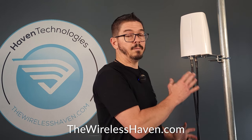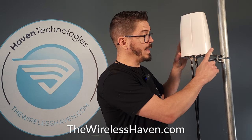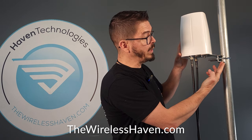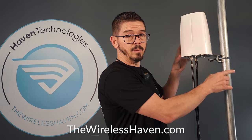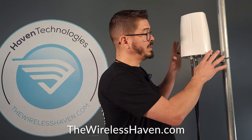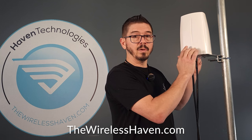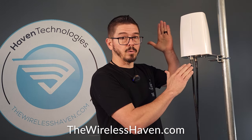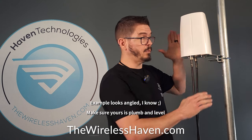Depending on the length of cable you need, you can use a lighter cable for shorter lengths or even heavier cable for really long lengths. The mounting structure that comes with it uses galvanized steel and a single U-bolt with a cradle-style mount so that you can mount this to a post or pole. It could be a J-pole, a post like this, or a telescoping mount that a lot of people like to use in RVs, and it can be statically mounted to any location and then rotated around. These do not tilt in any way because with omnidirectional antennas, you want them perfectly vertical, so you need to make sure that whatever you're mounting it to is perfectly plumb and level — perfectly straight up and down for the best optimal signal.